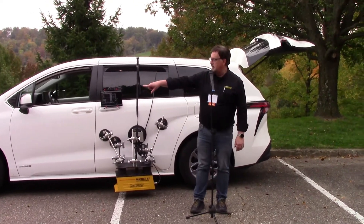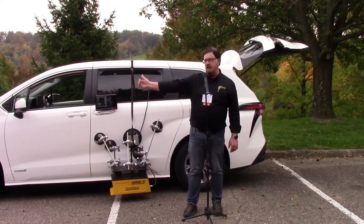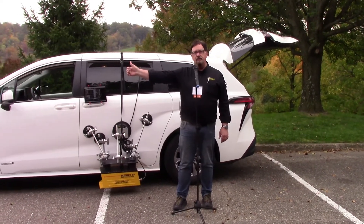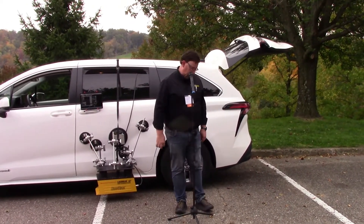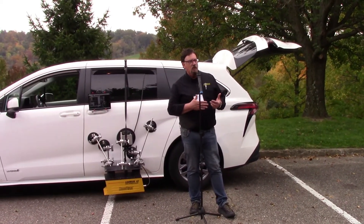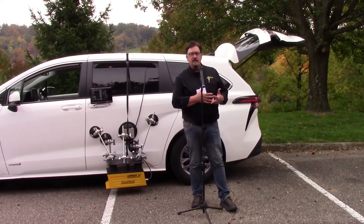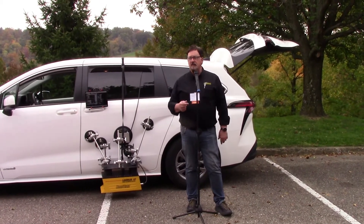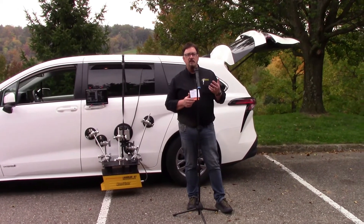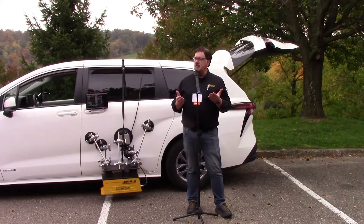Question: Is it looking down or is it looking forward? It's looking forward — it's catching just before the end of that temporary tape stripe I put out, right about 20 feet in front of the unit. This is our main standard retro laser unit. We also make a unit with two more lasers added that will read the color on the nighttime value against ASTM specs. And we have one more unit that you can put an infrared laser on that reads the line the way automated cars read the line — so you have human vision and machine vision in one.